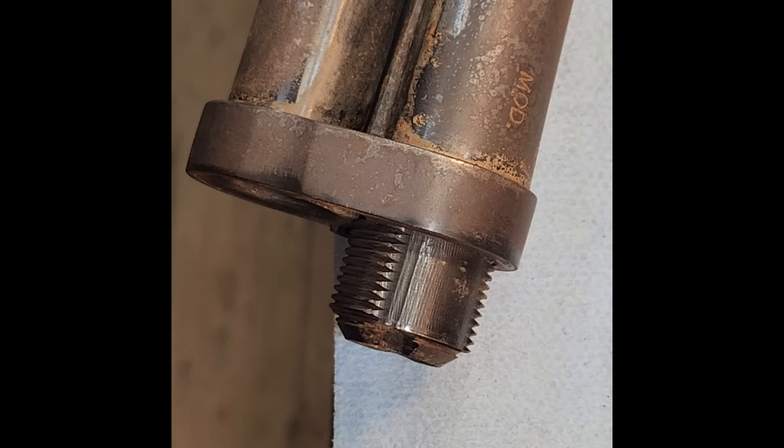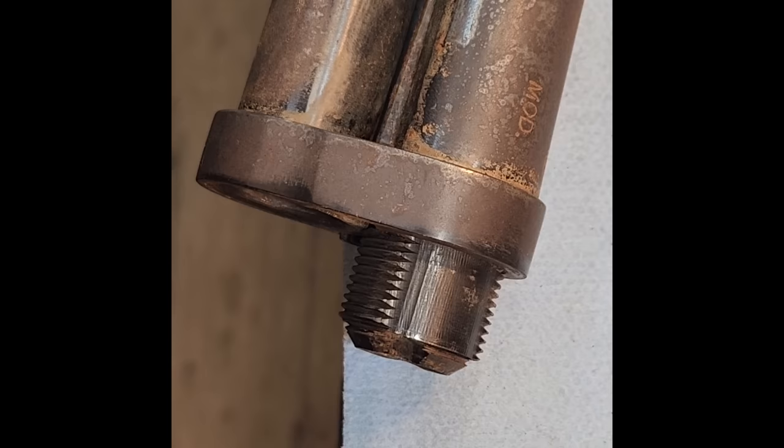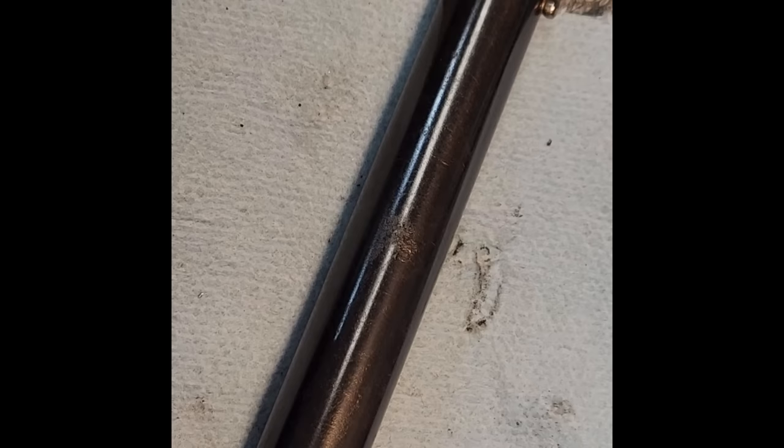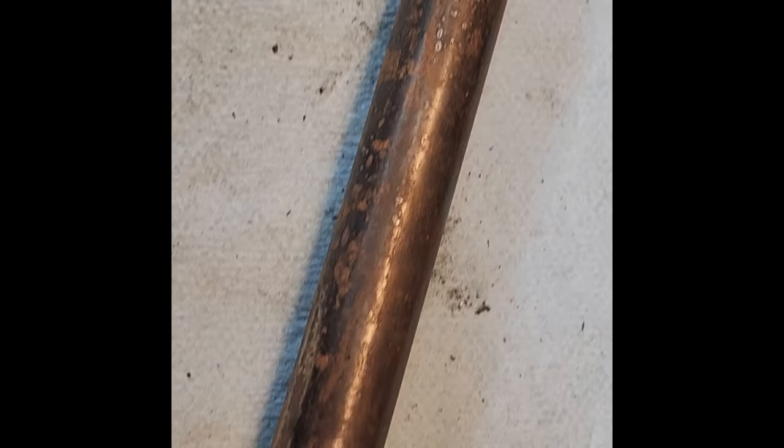So once you strip all of that patina off and you convert all of this oxide and you take all of the oil and boil it out, this is what the surface of this barrel actually looked like. And we'll go back in and card it. You can see up here by the muzzle, I had begun to card it, and we had to run it back through the tank one more time. This gun got run twice. But this is what you're looking at through the top. So I'm going to say again, patina is just a layer of oiled rust.